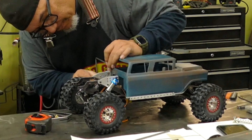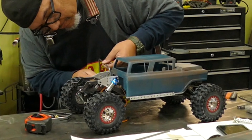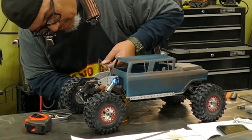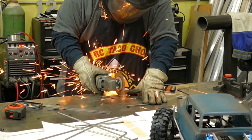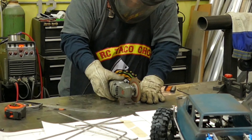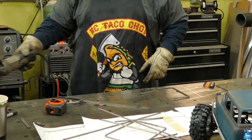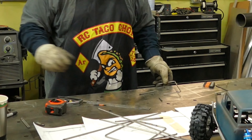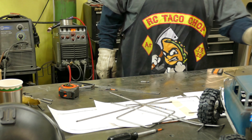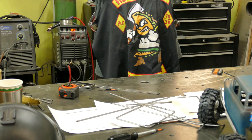When I start welding I begin with one of the hoops of the cage. I pre-bent what you could call a C shape to the right width, and now I'm marking how high I want that C to be — I wanted it to come down basically to the bottom of the rear window. I measured off camera to make sure they were even. There's a little bit of a twist, but you can fix that by bending it back and laying it flat on the table. Once it lays flat, you're good to go.